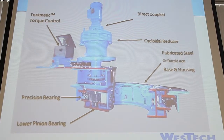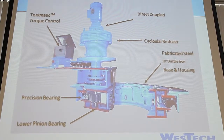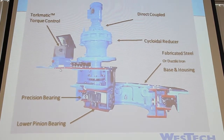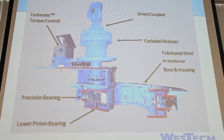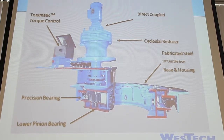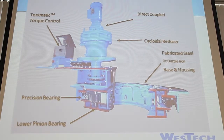That plate touches a little spring underneath. It's actually inside this box right here, underneath the torque box, and that spring is calibrated to be able to measure the torque. So, 5 pounds out there translated all the way across is X amount of torque, right? So as this spring and this arm distance right here, it's what's reading the torque.